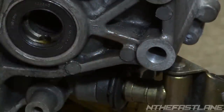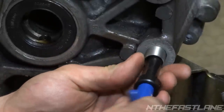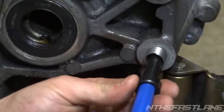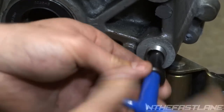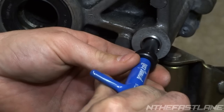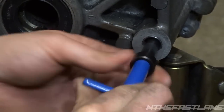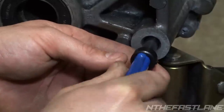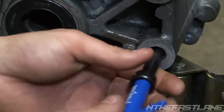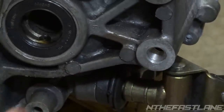Take the coil, put the tool in there like that, and try to get it started — just like that. Now we're just going to turn it and keep turning it. You'll see how smooth it goes in because I tapped it really clean, so you don't have to worry about getting stuck. We want to go a little bit past the lip — we don't want to be flush. Let's get it a little bit more. That's what we're looking at right there — looks pretty good.